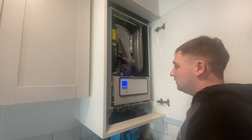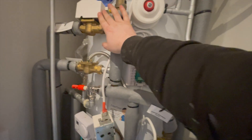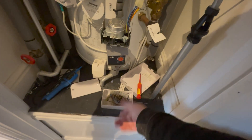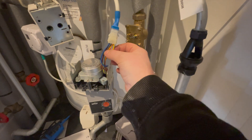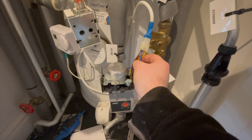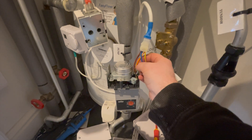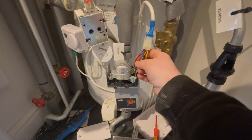So we've got our circuit board - it's ESI. Normally what you'd have is something similar to this, a basic wiring centre with a jumble of wires. If you're ever having problems with hot water or heating, you're looking for these specific wire colours. The rest are effectively just lives, neutrals and earths. That orange wire is a switch back to the boiler - that tells the boiler to fire up. The grey is always live, permanent live, and then you've got another switch live which opens the motor.